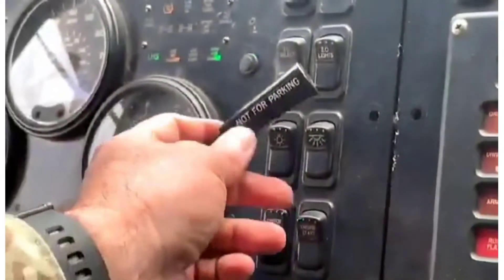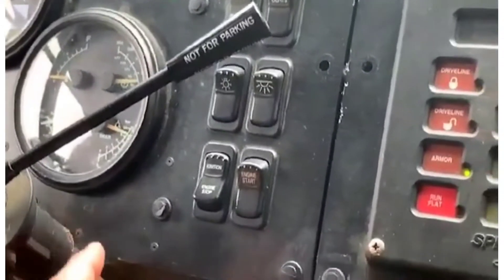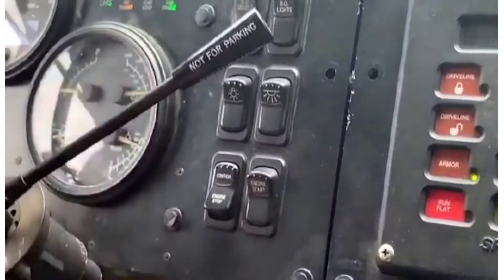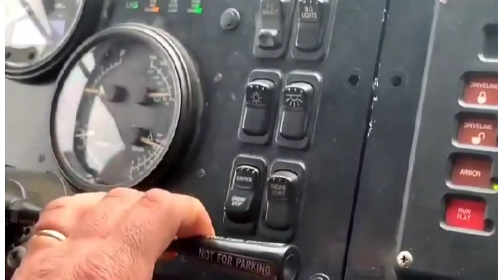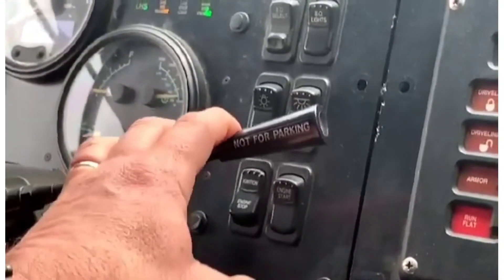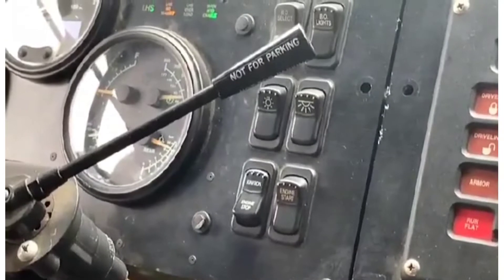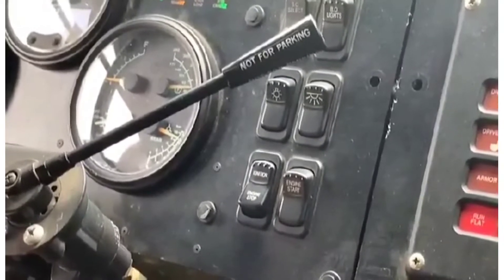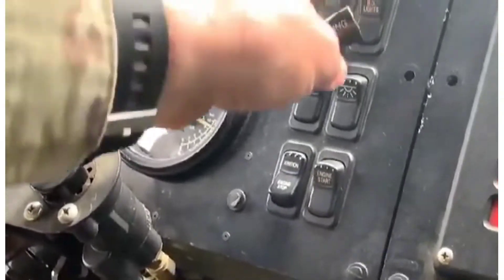This is kind of like a parking brake. When you're operating the winch, crane, or hook arm in the back, you need the vehicle in neutral — of course the vehicle is going to roll. So instead of pressing the brake, you can hold the vehicle and let go as needed, so your load will go under your vehicle. When loading the PLS, the vehicle goes under the load — you control the braking right here.